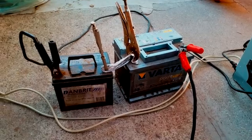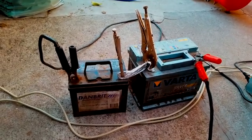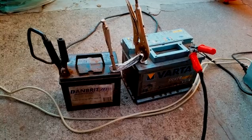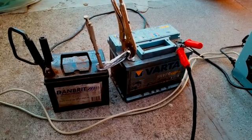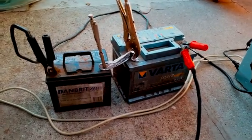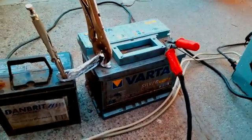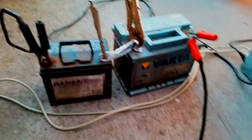These batteries are not meant for a UPS, and even though it's not just the load, it's still not recommendable because of the danger of the acid and the vaporing acid and stuff like that. Never serial connect or parallel connect batteries that are different kinds. These are both 12 volts, but this is a 28 amp-hour and this is a 62 amp-hour, so this one has a lot more juice in it. I'm willing to take the risk.